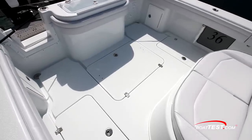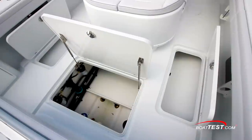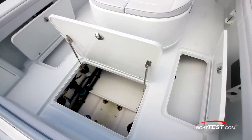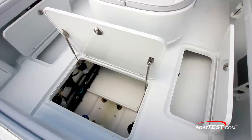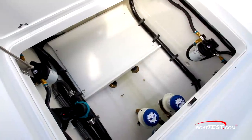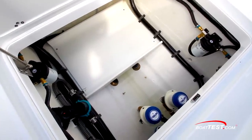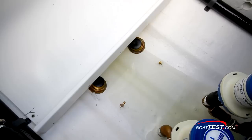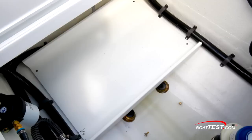In the sole of the cockpit are three hatches. To port and starboard are lockers with gasketed lids finished on both sides, equipped with lift-and-lock latches and tension hinges. The center locker has gas-assist struts to hold it open and is a mechanical space as well as stowage, with access to fuel filters for the outboards and through-hulls feeding raw water to the live wells. Also visible are the tops of the fish finder transducers tucked beneath the lipped shelf.